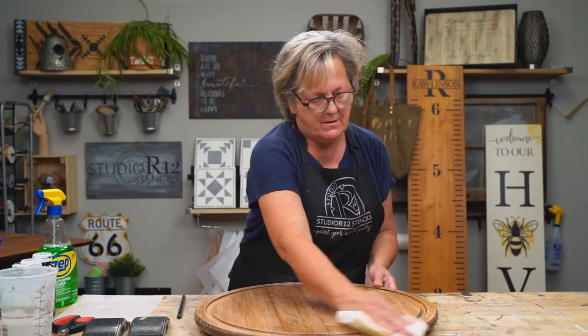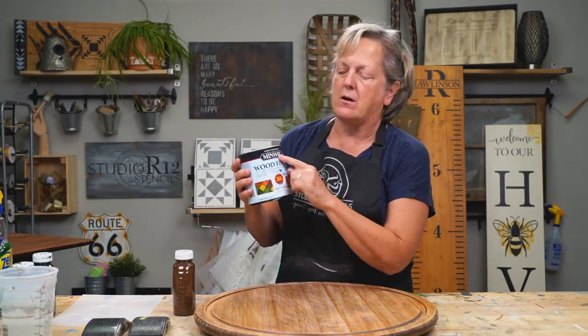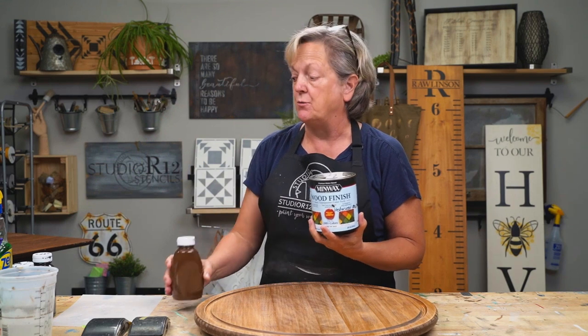Now I'm going to get out the stain and see if it's going to respond well. If it was raw wood we'd know it's going to take, but because this is already stained wood I don't know how it's going to accept it. This is Hedgewood number 1206 — the Minwax water-based stain — and it is an amazing product. I love these stains. We've put them in honey bottles — we'll put an affiliate link below. The honey bottles make it so much easier so it won't seal, and it's really easy to play around with your colors.